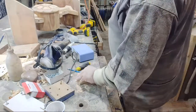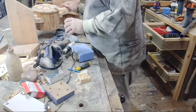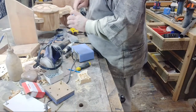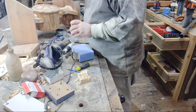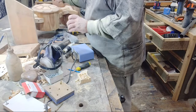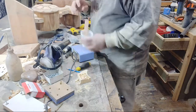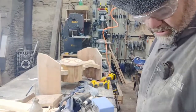But you have to be careful because you can still get imperial, and you can still get, obviously, metric. And the 3/8 is slightly different in size to the 10mm, for instance. Some plugs I've found too loose, some too tight. A bit of glue in those holes, and I'll whack those plugs in there. I know I can just fill the other bits, but it's just so much easier when you use a plug, because you just sand the plug and the filling's done, isn't it? I'll just put some glue in the top of these holes.